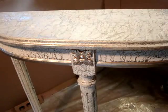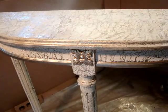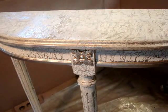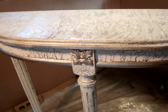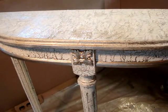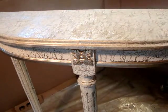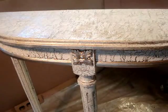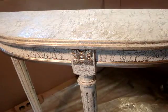You apply it as if you're painting the furniture, starting out on the top. When I get to the front band side, I'm actually going to lay it flat because I want the thickness there and I don't want it to run — flatness means stationary. That's one of the keys to putting on the glaze. I do have a small fan blowing, but it doesn't seem to be affecting the application — it's more for ventilation, and my garage door is cracked.